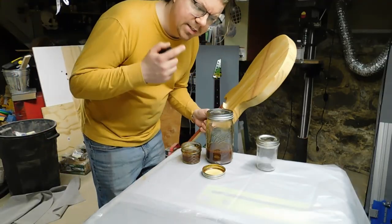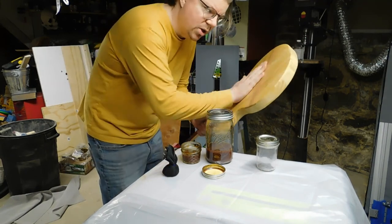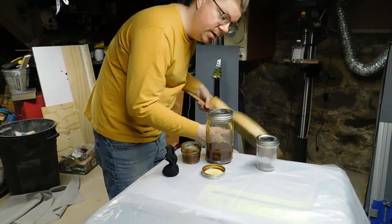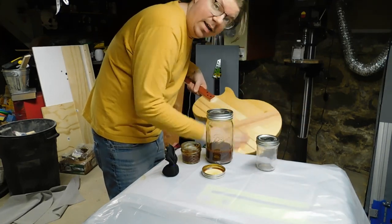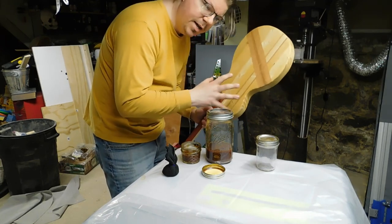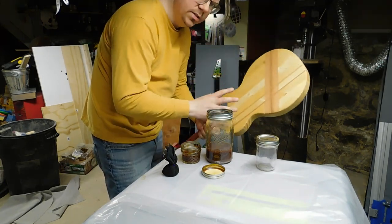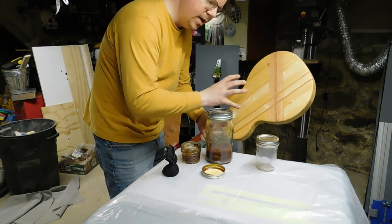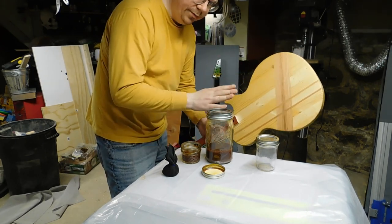One of the really cool things about shellac is it dries so quickly because its solvent is alcohol-based. By the time I've done the back coat, the front is already dry and ready for the next one. I'll be able to put a few coats on in one session, but as soon as it starts getting sticky or seems like it's not curing as quickly as before, put it away for the day.